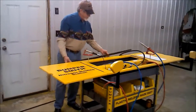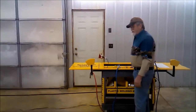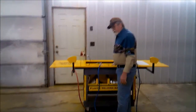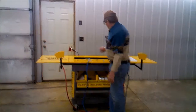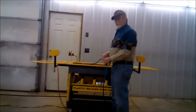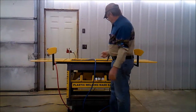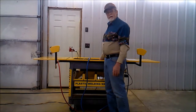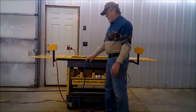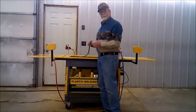That is the complete setup of this unit, other than adjusting your regulators at different times. The regulators are simple — you can pull out on them just a little bit and turn them to the desired pressure. These welders operate at about three pounds of pressure, and the gauge is only limited to go up to 15 pounds. You don't want to push the regulators too high, because you don't want to put over 30 pounds of pressure into one of these fittings — it's not designed for a lot of pressure.